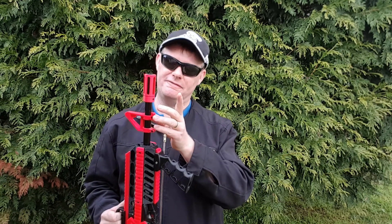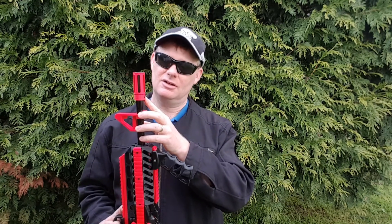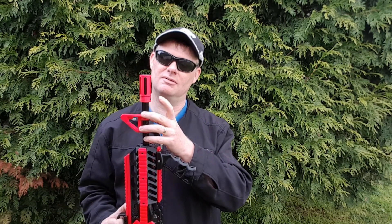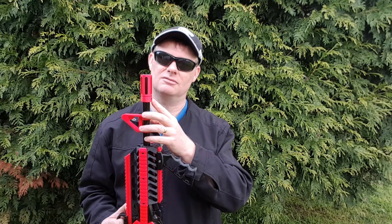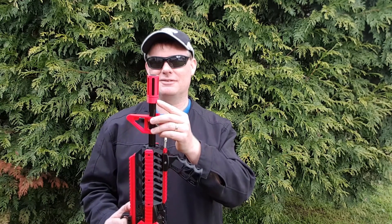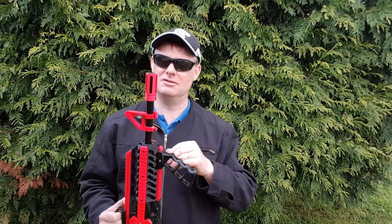On the very thin things, you probably don't need to tap it at all - and it's probably best not to tap it. You can just screw the screw straight into the PLA, ABS, whatever you want.